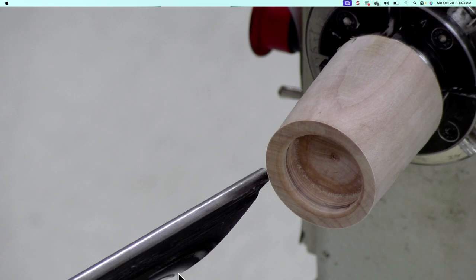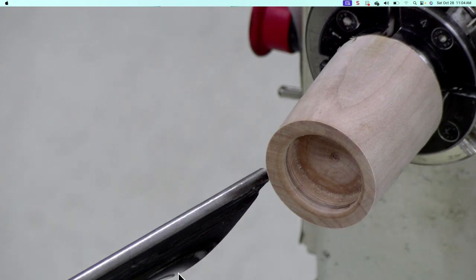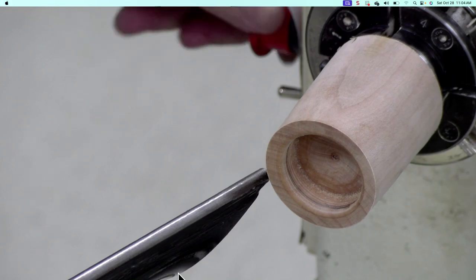Okay, and what I'm looking for now is sometimes it's hard for me to see with these bad eyes. I'm looking down in there. I want to get those threads. A normal thread is positioned like this and pointed at the top. I'm looking for almost that. In other words, I don't want them pointed at the top. I'm pretty darn close, about 80% formed, something like that.